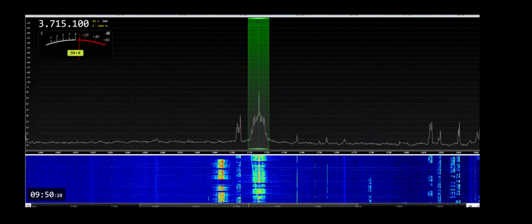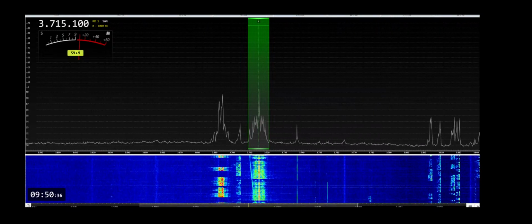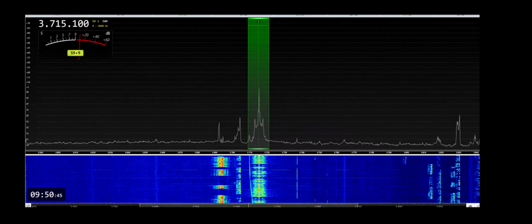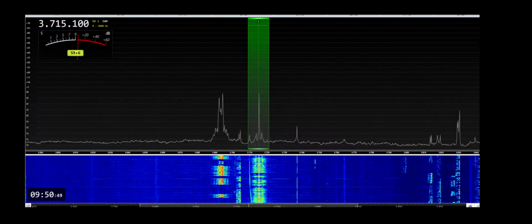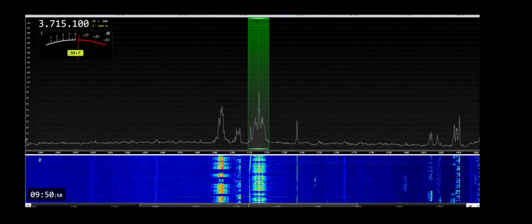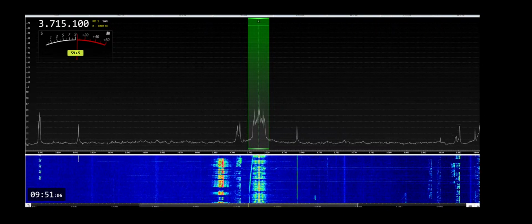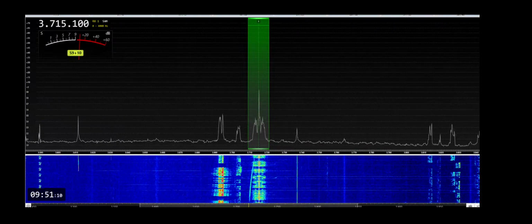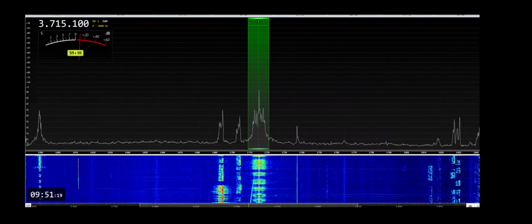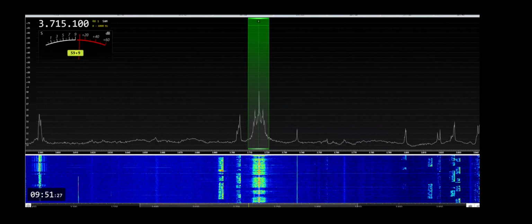Radio comments? No, I don't really have anything to add about the comments being made about radio stuff. I do have a PMR 7 and an AF-67, and I got to the point of rebuilding the power supply and wiring up the connector to the transmitter, and it was hardwired from the homebrew power supply into the transmitter plug, which I can't remember if it was a 15 or an octal. I think the PMR 7 has an octal connector. But anyway, the PMR 7 had a bunch of mods in it, so I wanted to double check the transmitter and see if they put any mods in it or rewired the plug. I got it to the point where I took the cover off and inspected it, and everything was factory fresh, so I knew the pins were going to pin out right, and that's where the project ended right there.